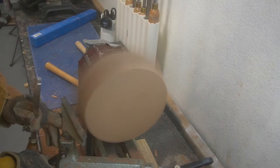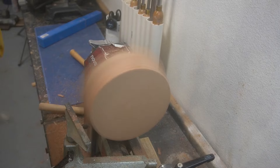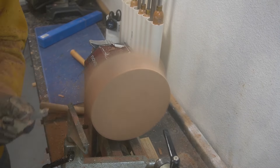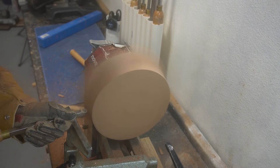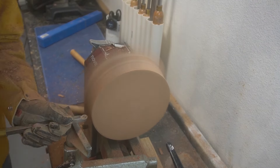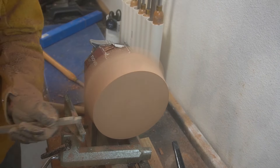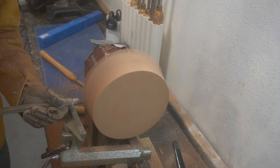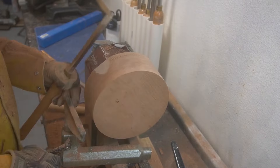But you learn. I was trying to use the square carbide tool and it just vibrated and sent shards of cherry lumber flying at my face — so wear your face shield, safety first. You can see the tail stock vibrating on the lathe as we work off the material, but we eventually got it to a cylinder. It's just the hassle of having to do it that way.